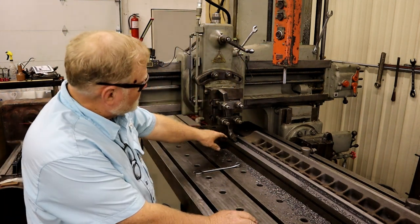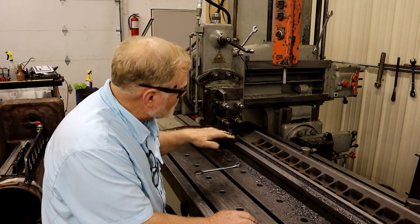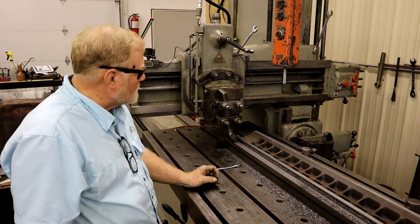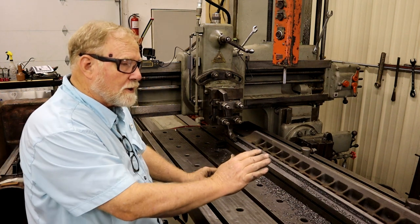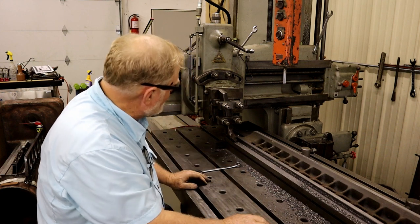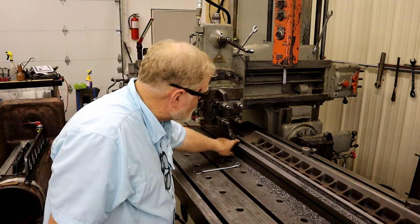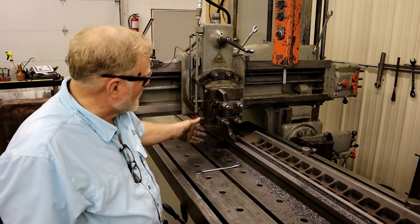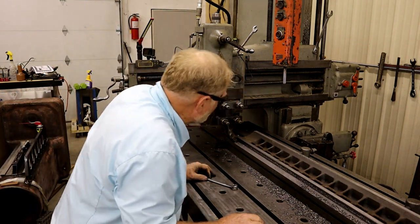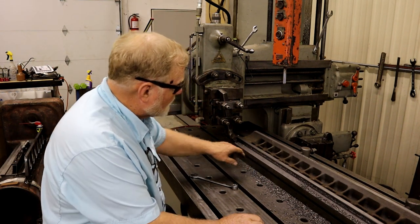All right, I had to reset the depth of the blade out of the holder because I was getting too close to this. Now I can reach all the way underneath there. One of my viewers made a comment that they used to set the tool down to where it would kick out and have enough clearance as it came back. Well, maybe I need a picture of that, because the way I have to set this specially ground bit, I don't see any way to do that, so I'll just keep lifting it. Okay, wish me luck. I've got to rough it out some more in there, and then we're going to get down to this level and take the final pass through there.